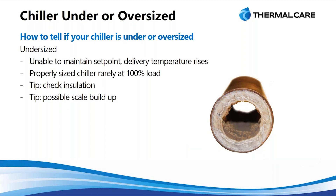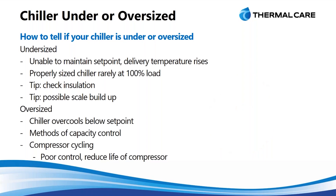There's also a potential for scale buildup. You'll see this more with a cooling tower system where the water is more contaminated with dissolved solids, but it can happen with chiller systems depending on water quality. It's very similar to what happens when we put glycol in — it inhibits heat transfer, essentially putting a layer of insulation inside the pipe, stopping the ability to absorb heat where you want it. Understanding your water quality and having a water chemistry expert review it is key. You may need to replace piping or the heat exchanger, or use acid washes and acid flushes to address it.